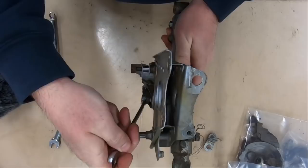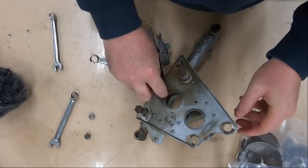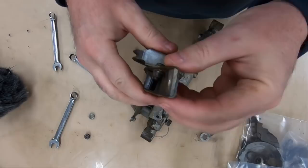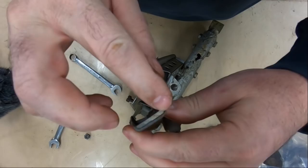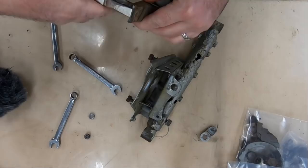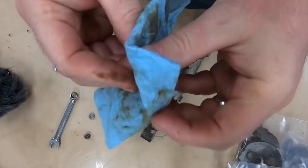So this is one thing I noticed specifically on this back HK panel, was the amount of little locking plates and special shims that they put in there. So you can see with that, there's another one. It's just a little piece of packing that's got radiuses put on it, but each one of them that I've found so far has their own Hawker part number. So I'll try and pull that out of there. There we go. Should be able to see that. There's the little Hawker number right there.